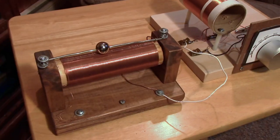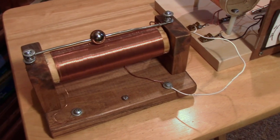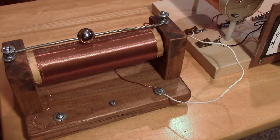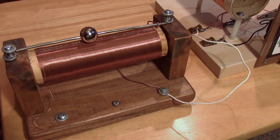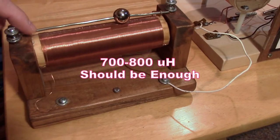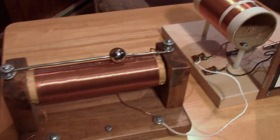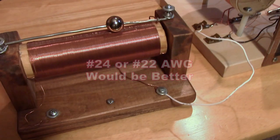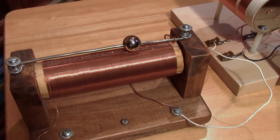The larger you make the coupling, the less your selectivity will be, but with the tuner you get that back because you're resonating the antenna. The tuner is about 300 turns of number 26 wire. The ball on top is a nickel-plated brass ball — very easy to drill through. I'm using heavy number 10 tinned wire as the slider, with a spring suspension system that gives as you slide the ball across. It doesn't contact one turn at a time like a perfect tuner would — probably getting two or three — but it still does a tremendous job.